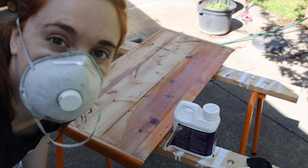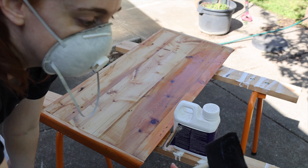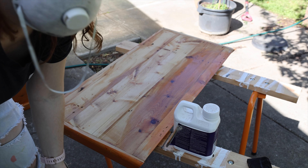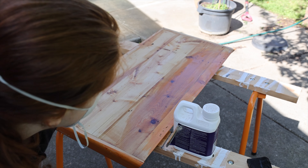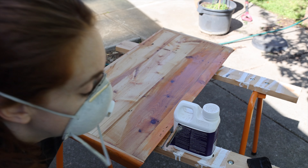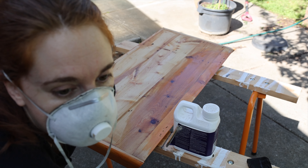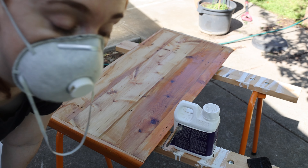The only thing I will say about the paint stripper and these little brushes is that they disintegrate pretty quick, but I prefer using those and wasting them — as bad as it is — than using brushes and having to get turps and clean them and all that business. We're going to leave that for 15 whole minutes and then come back and start getting all the stain and stuff off.